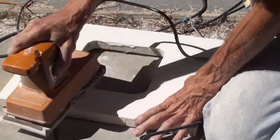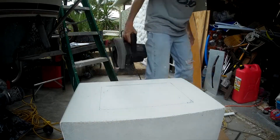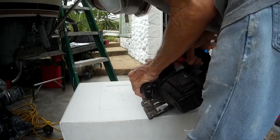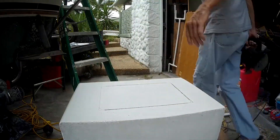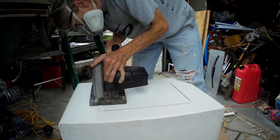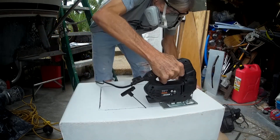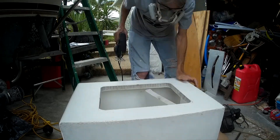Teal from Onboard Lifestyle gave me this tip: I'm cutting the straight sections with a circular saw, because that lets me do plunge cuts and is a better tool for cutting a straight line. Once I've got my straight lines cut I can come back with a jigsaw and cut the curved parts at the corner with a saw that works well for curved cuts.